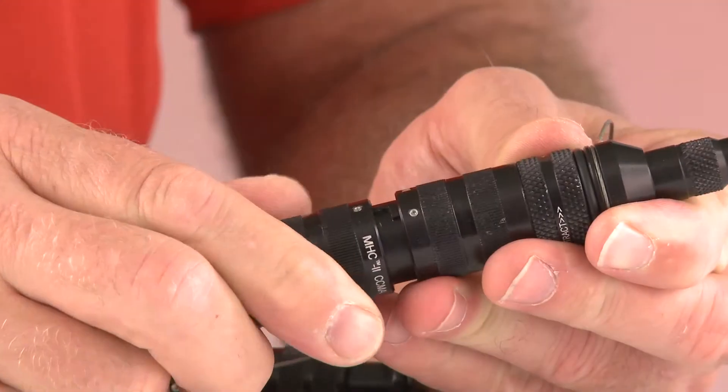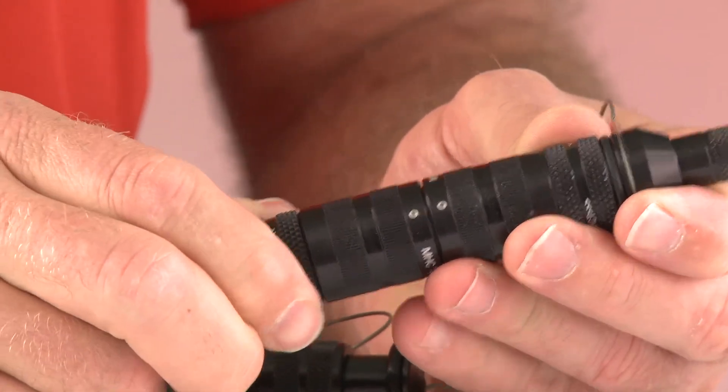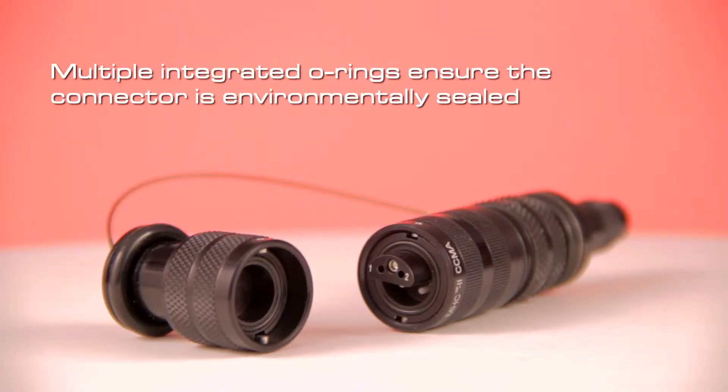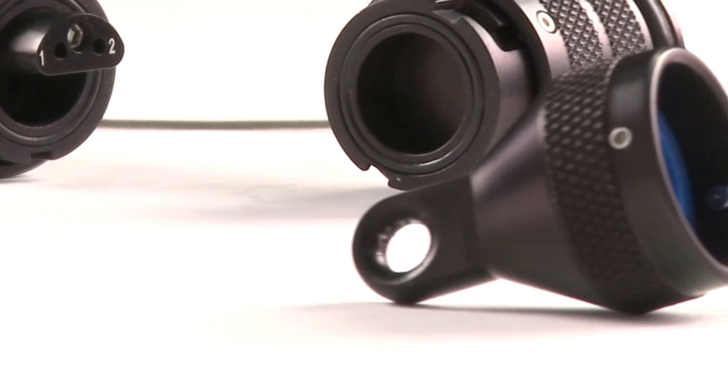The MHC 2 features these innovative and convenient characteristics: bayonet coupling is secured by a rear locking nut to prevent accidental disconnect; multiple integrated o-rings ensure the connector is environmentally sealed for indoor or outdoor use; and exceptional cable retention capability meets TIA 455-6 cable retention specification of 400 pounds minimum when using military tactical fiber optic cable.